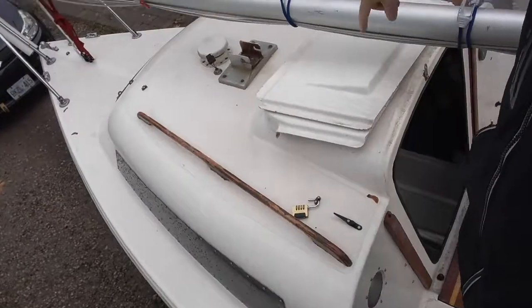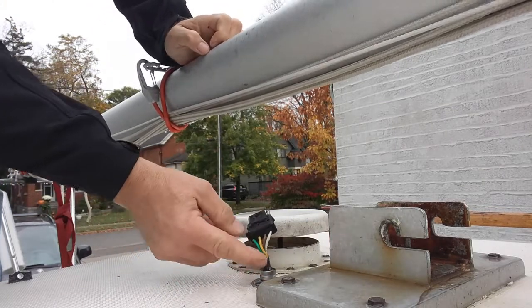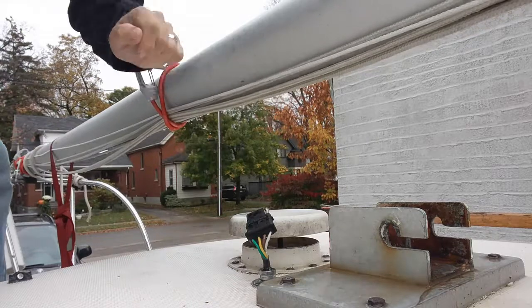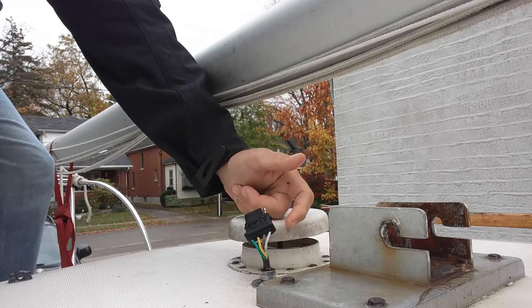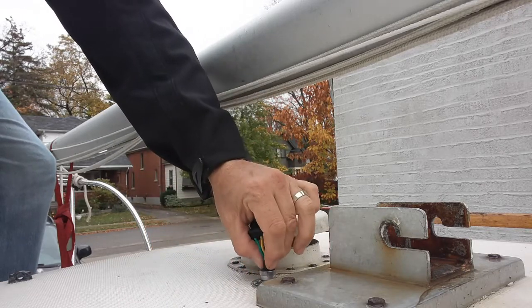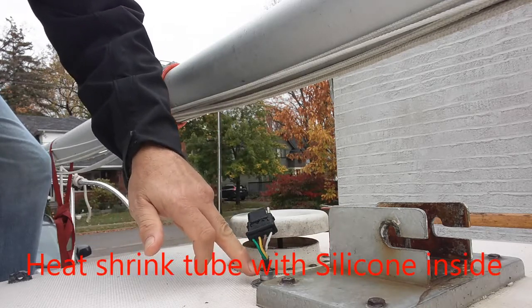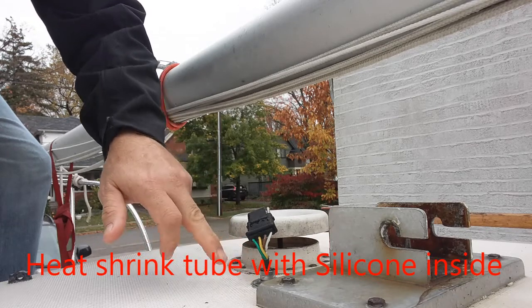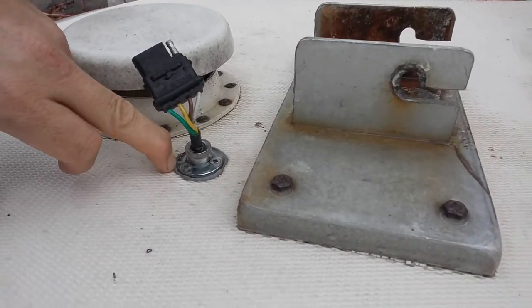I'm on my Siren 17 and I'm going to show where I've got my wiring coming up through the top of the cabin. I drilled a hole through the cabin and installed a through-hole — this is a trailer wiring harness plug. I used that because it was what I had available. The wires go into a round jacketed fitting where I put silicone to protect against water intrusion. I've also used butyl tape — that's what this gray stuff is.